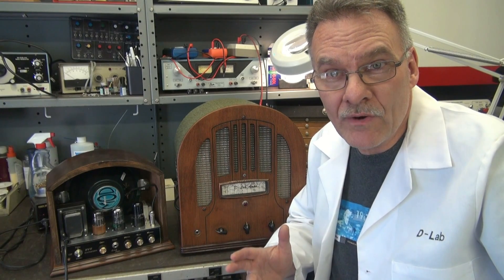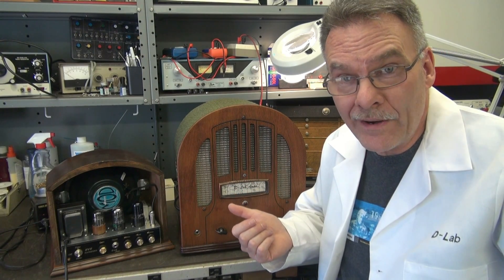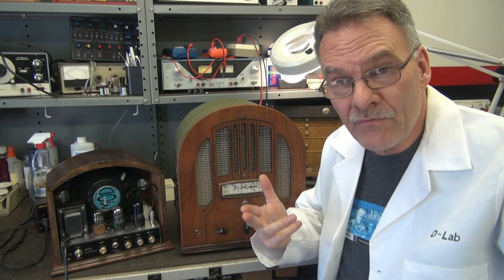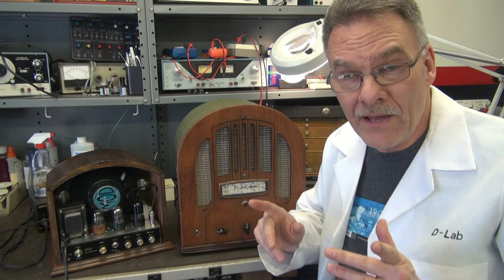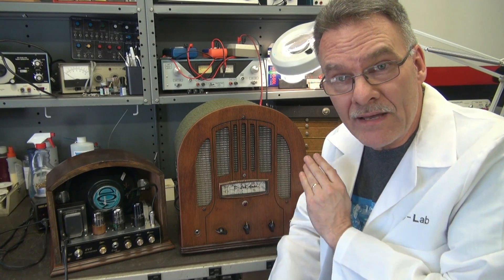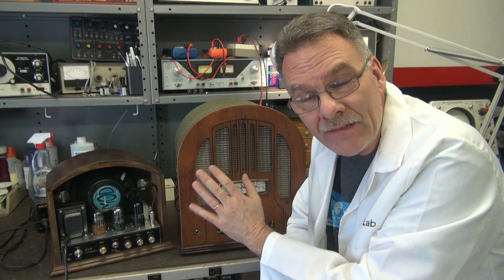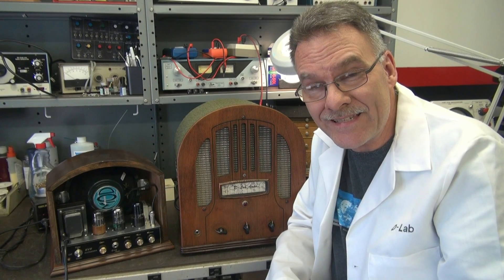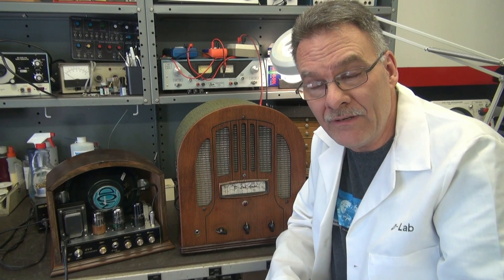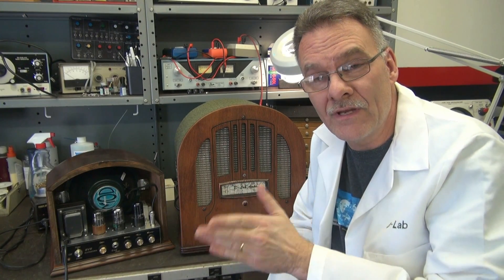It's Terry back with you here at D-Lab Electronics with a follow-up video of the Cathedral Amplifiers. As you know, these are built in old 1930s Cathedral style radio cabinets. The big one we just had a couple videos on showing its performance into my extension speaker, which has two 12-inch Celestions, but it also has its own built-in 8-inch speaker made by Selenium, and I want you to hear what that sounds like. Then there's its little brother, a tiny five-watt Class A amp similar to a Fender Champ, but it runs a 6SL7 tube and has a built-in 8-inch Jensen mod speaker, so I'll let you see how that one sounds with the built-in speaker versus the external.